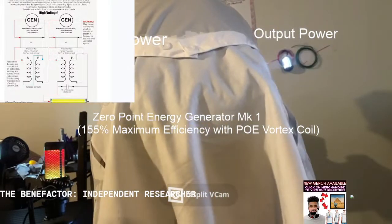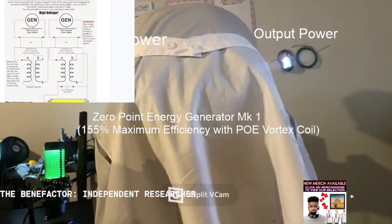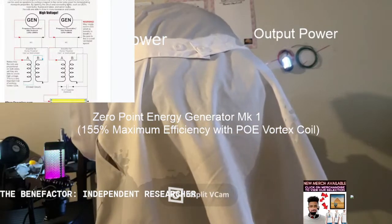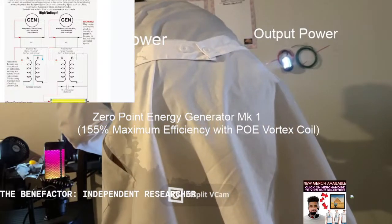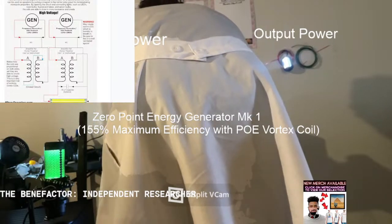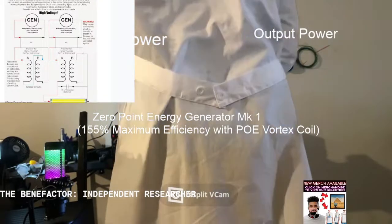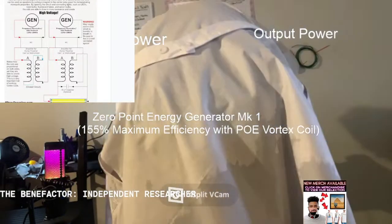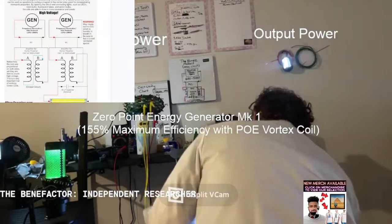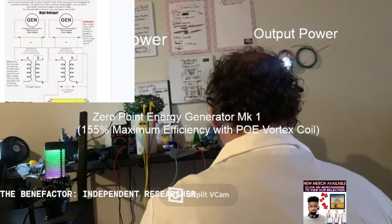So what we're going to do is we're just going to take this yellow wire right here. I'm going to disconnect it from the output circuit, repurpose it as a connector between channel A and channel B. And leave that down here. All right. Let me just bring this up real quick and take a look at the diagram real quick and go over it just to verify.